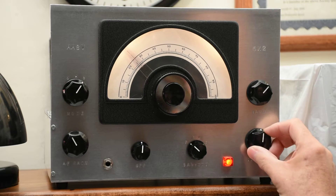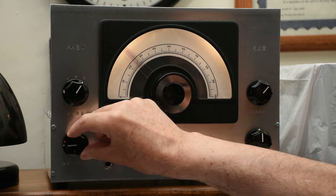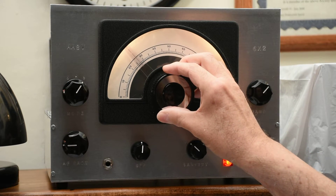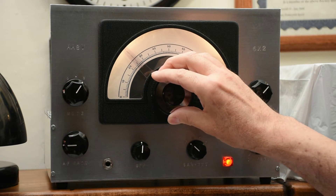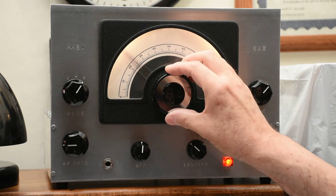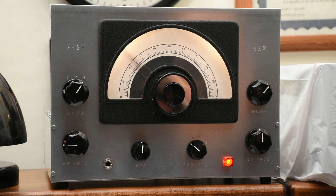To use the audio filter, I set the IF gain at 12 o'clock and the audio gain at 9 o'clock. I'm going to flip on the filter now, and now the receiver tunes as easily as any other modern receiver. We can open up the selectivity, we can turn it down, we can open it up, and we can control the volume on the external audio filter.